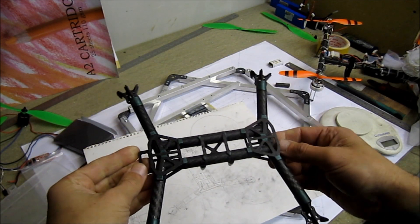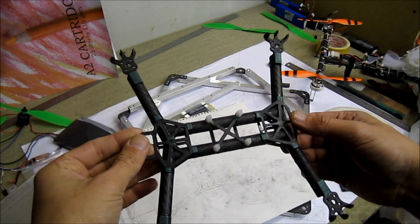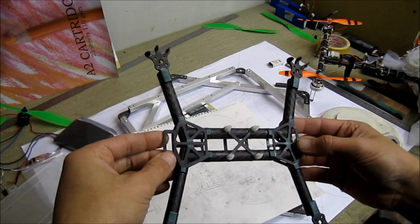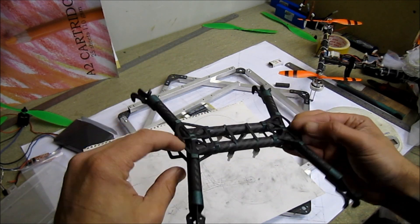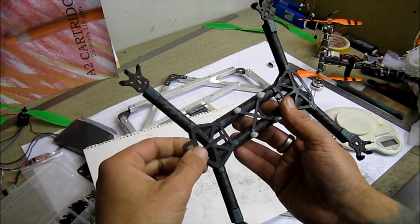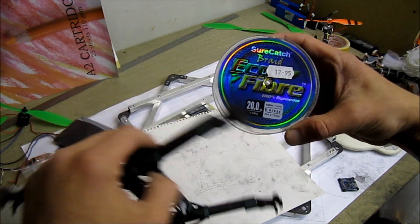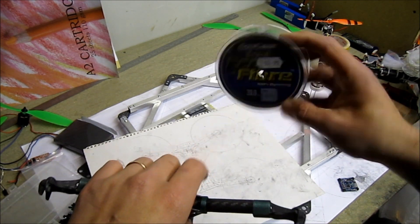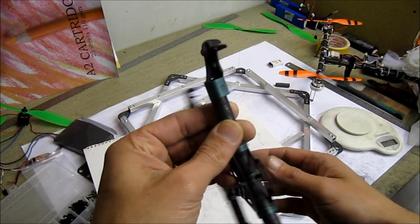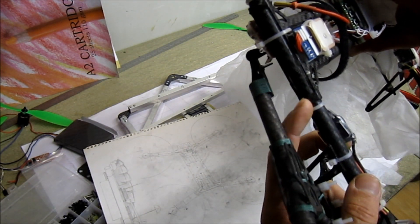I have another upcoming project. I want to show you just the bare frame because once I put in all the electronics it's hard to see what's done in there. My mini H-quad carbon fiber frame — minis are taking over the world now, pretty much the best fun thing to bash around between the trees. I used 12mm carbon fiber booms, all carbon fiber plates, and wrapped it with fishing braid line. The windings look more neat than my previous quad when I used carbon fiber threads.